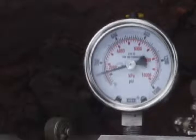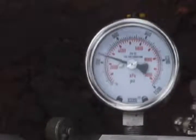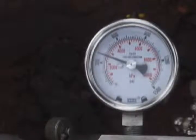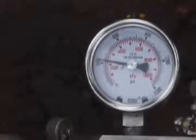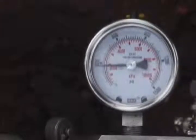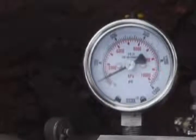If during use the pressure gauge shows the gas gun not building or holding a positive pressure, this could indicate a leaking gas valve. It is likely caused by the smaller of the two O-rings on the gas valve being cut. To repair this problem, we will remove and replace the O-ring. This will require us to disassemble the gas gun in four steps.